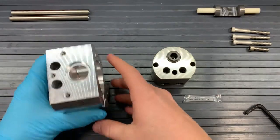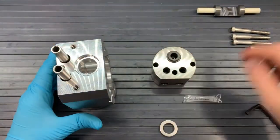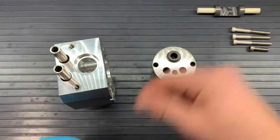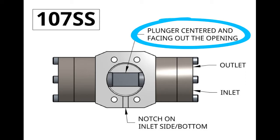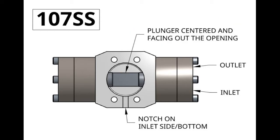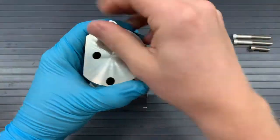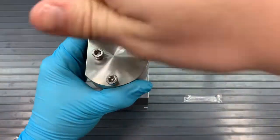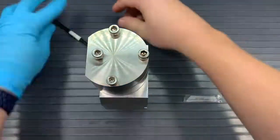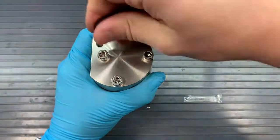Once those are tightened, we will flip it over and put in our steel tubes. With those tubes in place you'll feel a little seal and pressure on the other end. Next, put the plunger in with the slot facing towards us so that our cam from the motor can reach it — we'll want it flat and centered facing us. With that plunger in place, put our second steel washer over top of that, then grab the second head and stuffing box assembly and flip that over the top. Grab our four remaining bolts — put the three long ones in and the short one on the top round edge — and tighten those. Double check that the other side is tight.